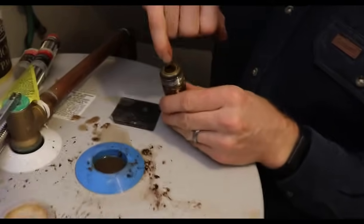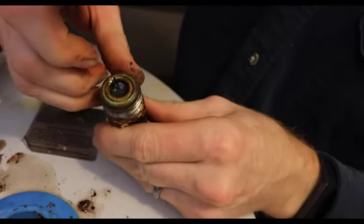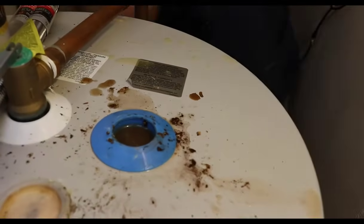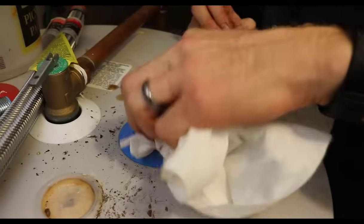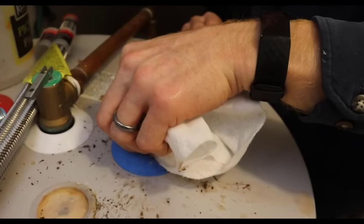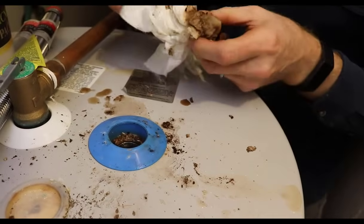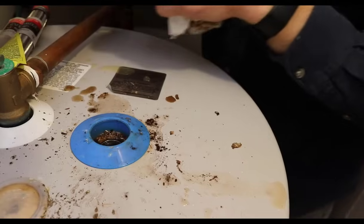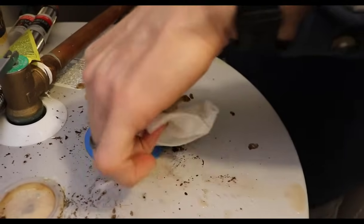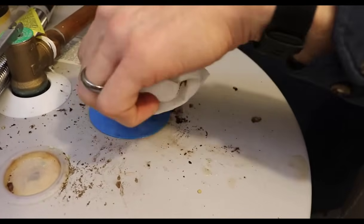So this also has a heat trap in it, a little flapper valve. So probably soak up some of this water. Drop the water level down a little bit. There's just all sorts of corrosion and nastiness there. Do you know why it's corroding? I'm assuming there was a small leak at the connection.